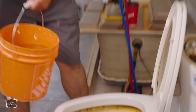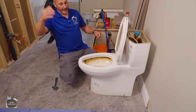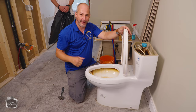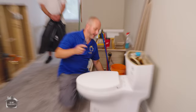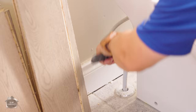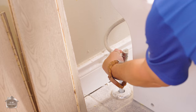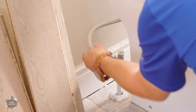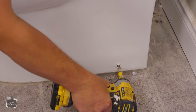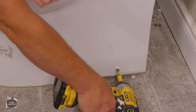The water level used to be here, now it's down here — so in the backside of that P-trap I've got a few inches to play with. No need to grab a vacuum and shove it in a toilet full of bacteria. You want to disengage your water supply from your shutoff valve — a couple of turns, it should be just finger tight, and you'll get a small dribble. All toilets have some sort of connection system to the floor. In this case there's a little cap and a screw that attaches to the floor. Be careful and pay attention to which one you have — traditional toilets just have white caps with toilet bolts, and you might even need a hacksaw to cut those bolts off.